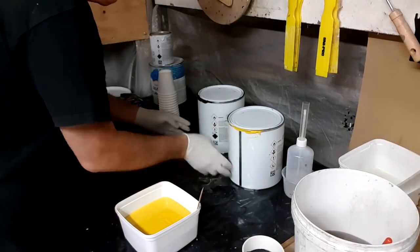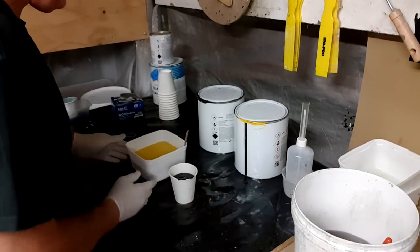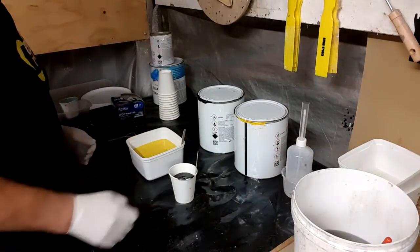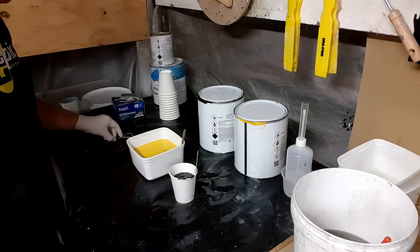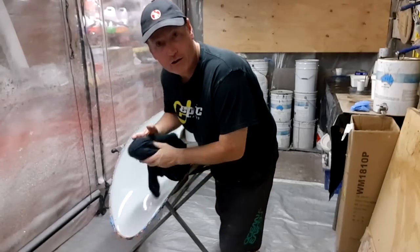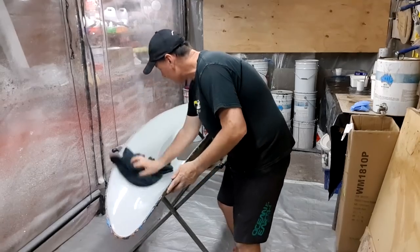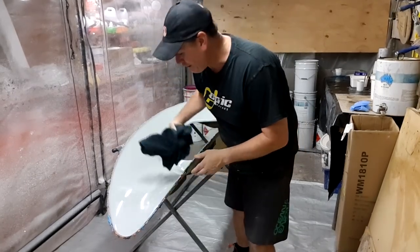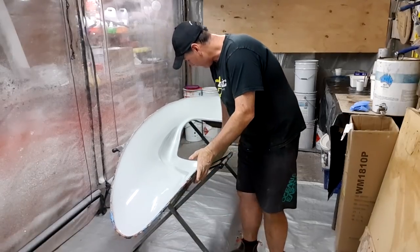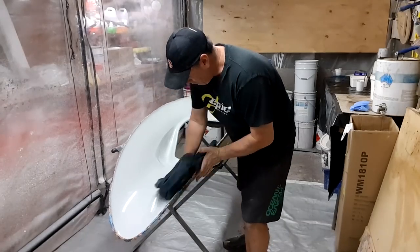Okay, so we're done with those. The important thing to do now is to get myself ready for the ensuing gel coating routine that I go through. Always use one cloth and then I'll take another clean cloth and just do that final wax removal. So this one's already getting full of wax. It's my general purpose one. I tend to wash them about once every couple of weeks just to make sure they're cleanish. Get as much of the wax out of them as possible, because I don't want to be adding wax to an area that I've already removed it from.